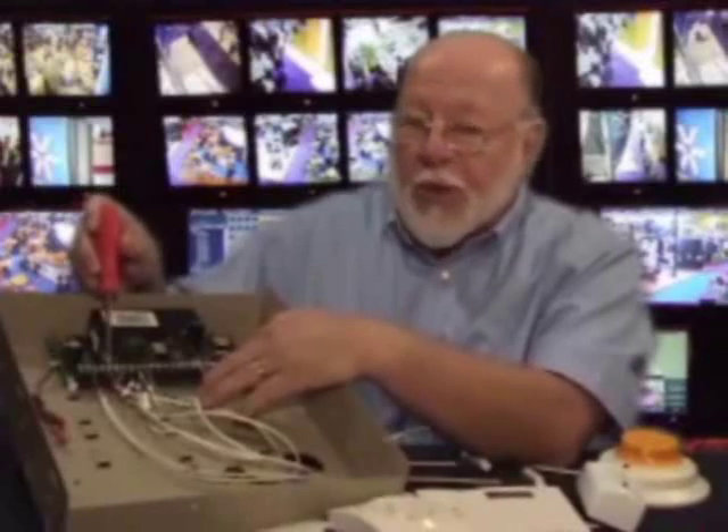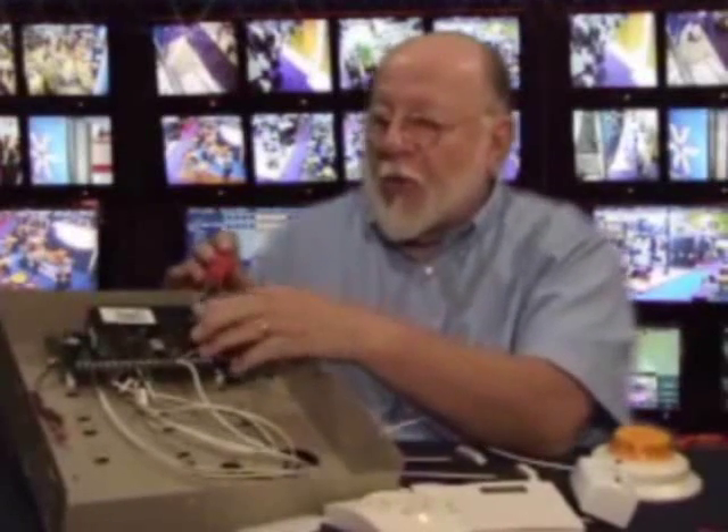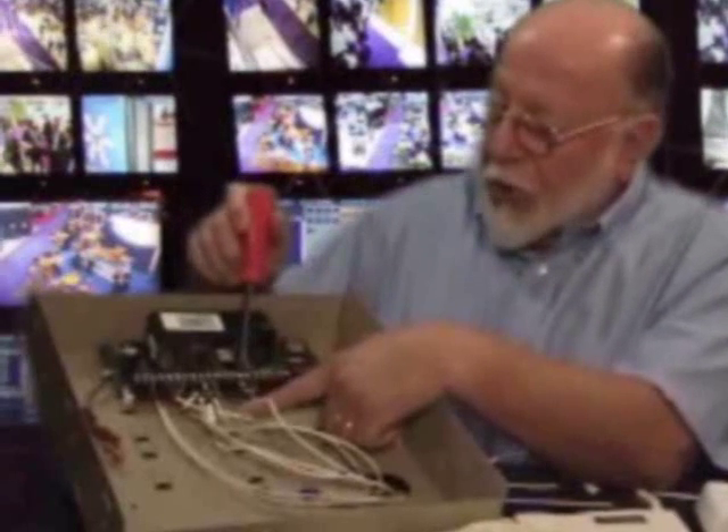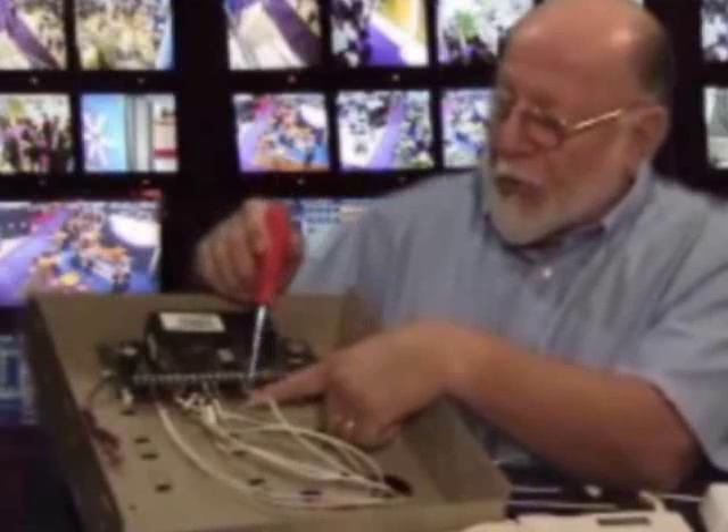Let's move on to the smoke detector. We'll separate our sensor wires from our power wires. The black and the red will get connected to the plus and minus power of four and five. The sensor goes to zone number five, which is already programmed for a smoke detector. We've connected our minuses with the minus, our plus with the plus. Now we're going to connect the zone screws. You'll notice there's no resistor in series with this detector — that's because smoke detectors are normally open, as we spoke about earlier. They require the resistor to be in parallel across the two screws. Some people mount it in the box, some mount it at the end of the line where the detector is — we recommend at the end of the line. That connects our smoke detector to screws 14 and 15, with a resistor across both screws as well as the wire.